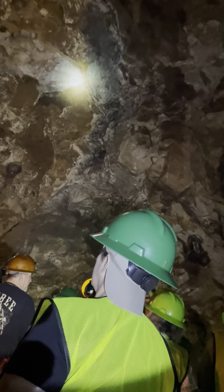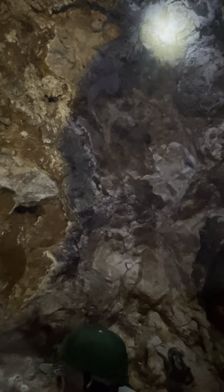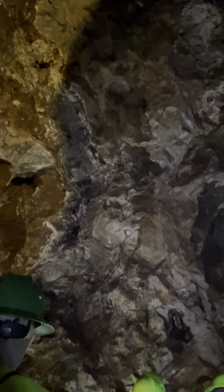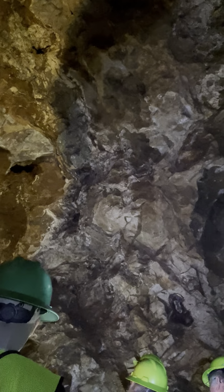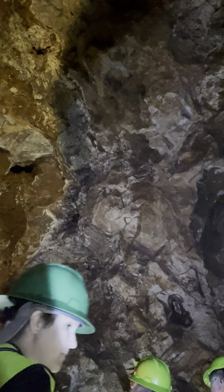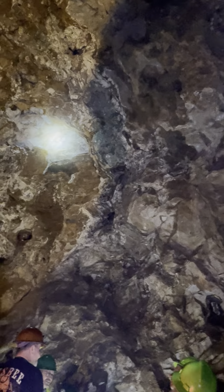Up above, on the side of the mountain, there's a big 50-foot fan set up there. And it blows down into this mine. And all that fresh air it picks up goes right down through the stope and down into that tunnel down there. And that air door that I opened up, we shut that when the train goes through to force that fresh air back to where the tour goes. Cool. So, no worries, we're okay.